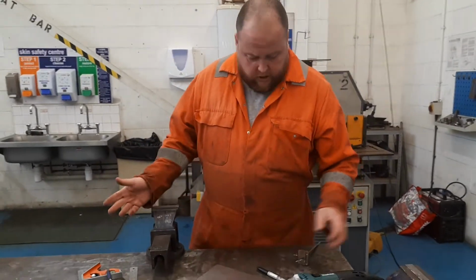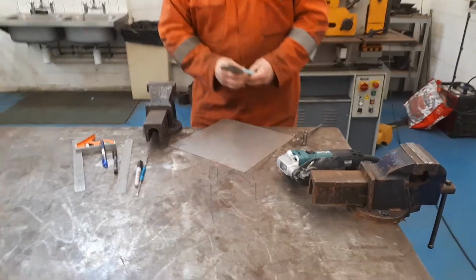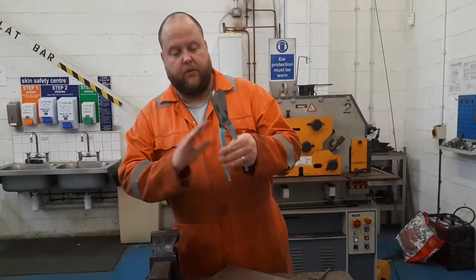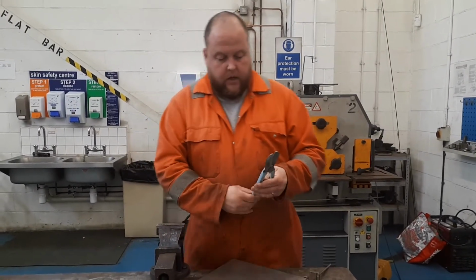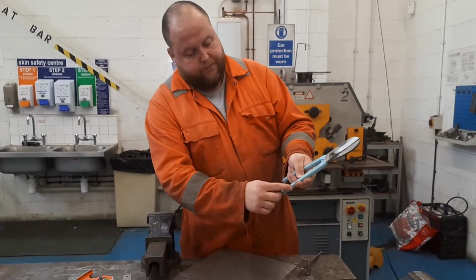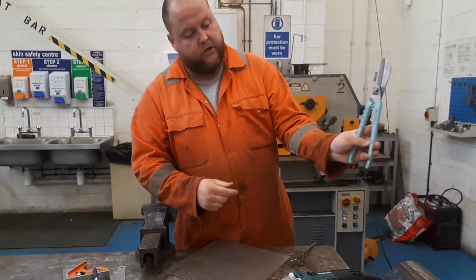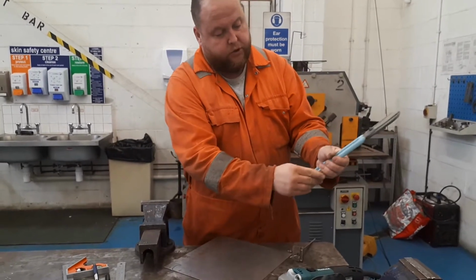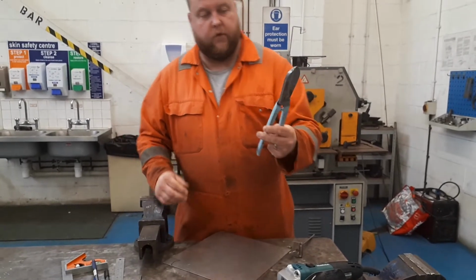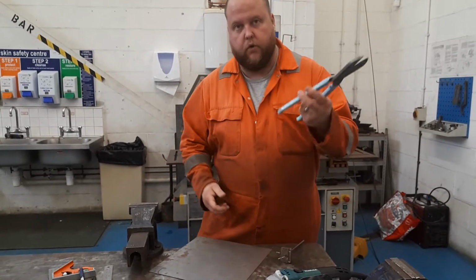So options are, as I said, you've got the options of using a pair of tin snips, quite simple really. One thing I would say is, although I have fingers on the outside, depending upon the thickness of the material, obviously sheet material, this is 1mm, I normally have 2 fingers on the outside and 1 on the inside. The reason for that is as I push back, I'll push back with my finger or my thumb, or you might have it like that, and your finger on the inside like so. So that way when you push back, as you push them together, you can actually push it apart. It's not spring loaded, so it's just about keeping control. If you've got a lot of material you need to cut, then you're not trying to pull it back apart, you've got all the control over one hand.